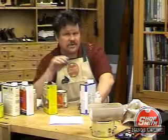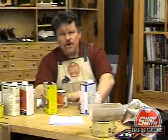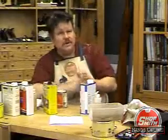You want to leave the surface wet, but evenly wet. No places where the finish is pooling up in cracks or crevices. You can use the same cloth that you use to apply the finish. You just wring it out and use it like a mop. Get it full, wring it out, and keep going back until the surface is evenly wet. Let it dry thoroughly between coats. Put on the next coat in 8 hours. Better at 24, no more than 48.